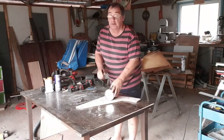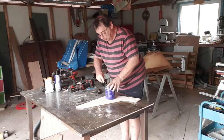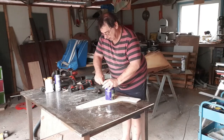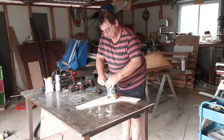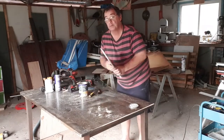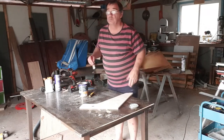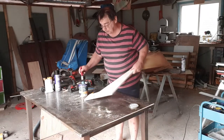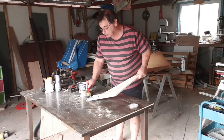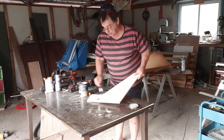British Paints water-based clear finish. I used this on a few boats, and what I found using normal lacquers is the lacquer ends up flaking. How I figured it out by using this was I built myself a letterbox and I coated it with this stuff, and that was 5 years ago, and to today it still hasn't swollen up. The lacquer is still on it, hasn't peeled off of it. So I'm pretty much under the impression that using a water-based lacquer like this, and you lather it on, you don't just bugger right around and put a little bit on there, you lather it on and make sure you get into all the areas.